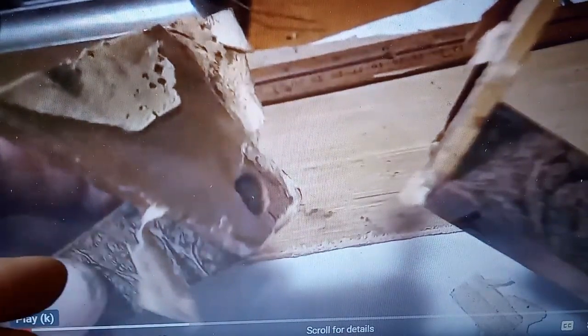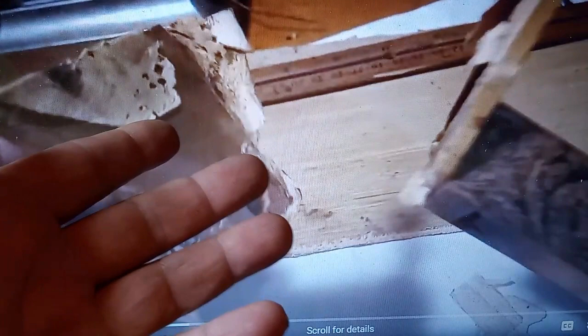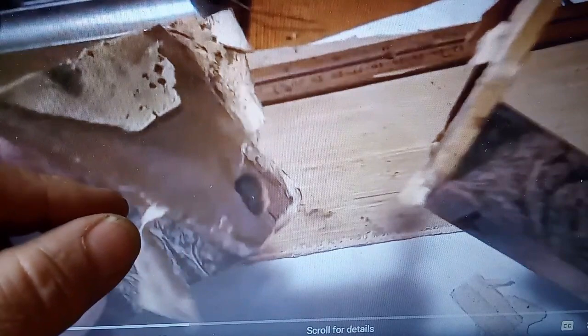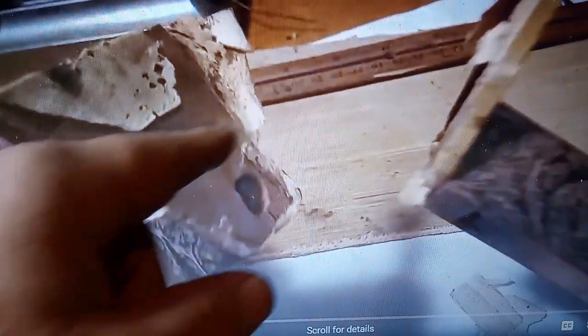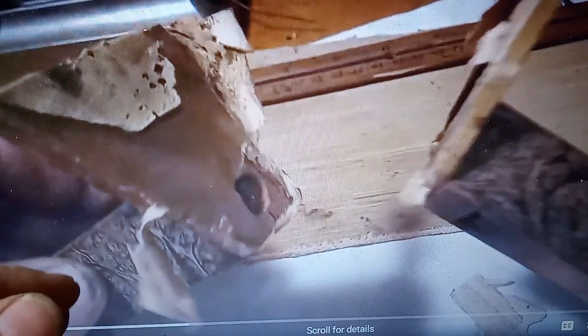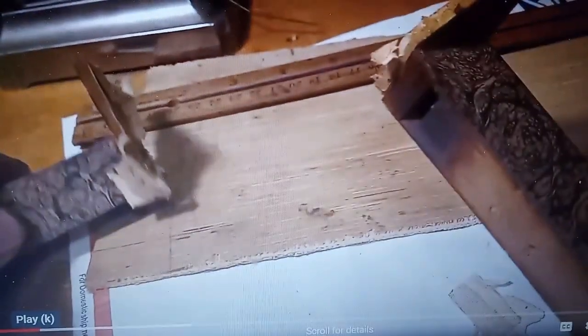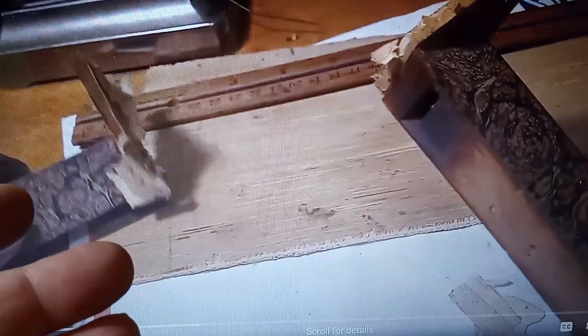And if you're repairing an antique clock, you can actually make this stuff out of wood. I've done it, but you have to know where to put the hole. I've done this out of thin plywood. You can make it yourself, but Timesavers sells this stuff. And if you're repairing an antique clock, you should put triangular shaped bellow tops on it. You should also use leather, which is what it came with.